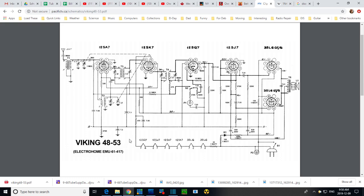This guy is meant to carry at least, I can't believe it. Like in most houses like mine, I have a 15 amp breaker, and a lot of people think, well, it'll only let 15 amps through. No, that's not the right answer. The right answer is it'll let through whatever is available for some very short period of time. Maybe 4, 5, 6 cycles. This is a fraction of a second. But it could be 100 amps or something like that.